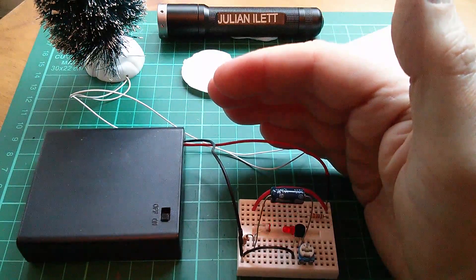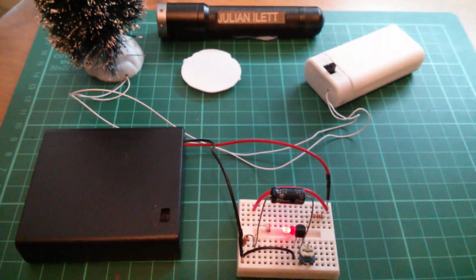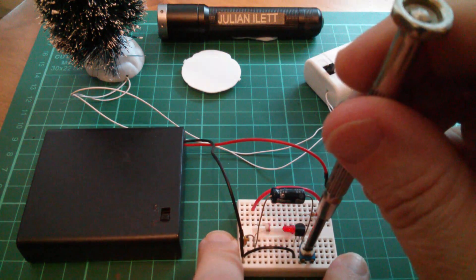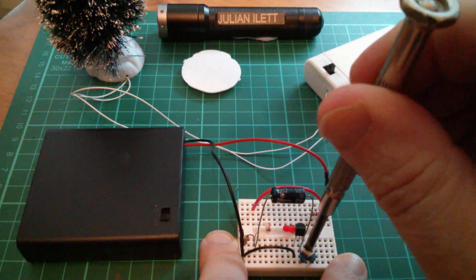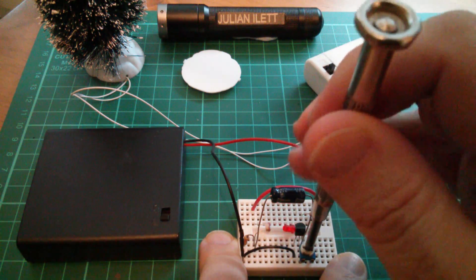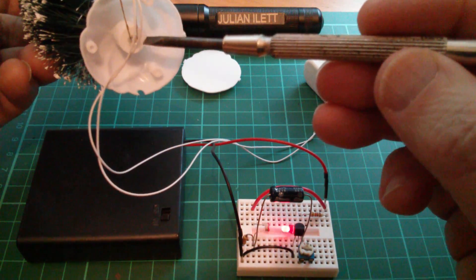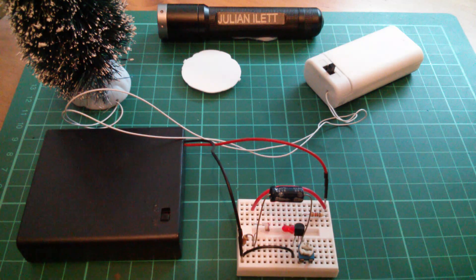I'm going to shut the blinds to get it to a state with not too much ambient light. That's got the LED flashing at a more moderate rate — it slows down if I reduce the ambient light even further. This resistor, which is the feedback resistor providing negative feedback between collector and base, can be used to vary the flash rate. You can also vary it by changing the capacitor, but you don't get variable capacitors in big sizes like that. So I think I'm just going to shove these components into the bottom of this tree if they'll fit, somehow mount the LDR so it can see the light from the LED, and make a flashing Christmas tree with just one transistor.